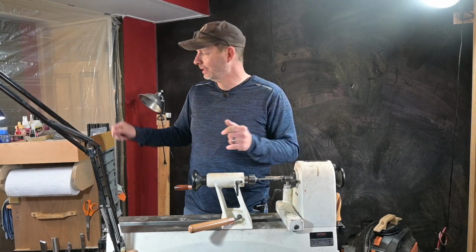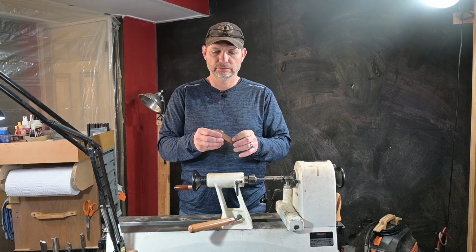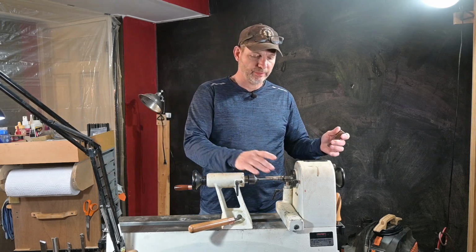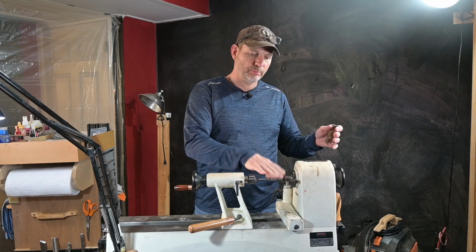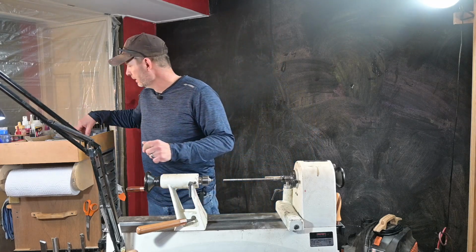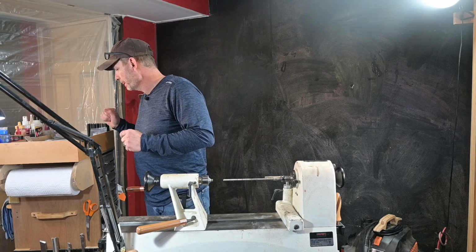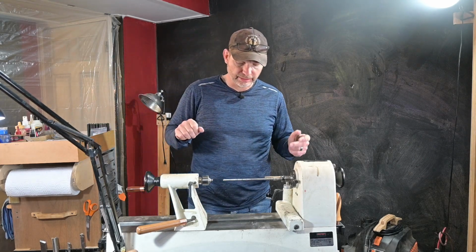All right, here we are at the lathe. We're getting ready to turn the workshop pencil on this Mora wood. This is gonna be beautiful. So I got my normal setup here. I got the #2 Morse tapered pen mandrel, my mandrel saver. They're both #2s. A couple extra spacers, and I have the bushings for this kit. This is all from PSI, Penn State Industries. And I'll get my vacuum set up and we'll get to turning.